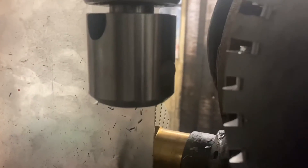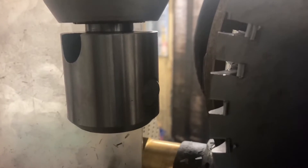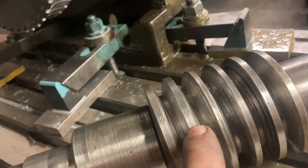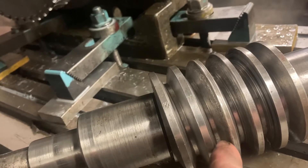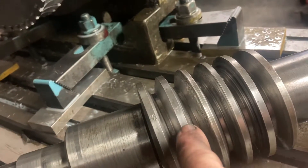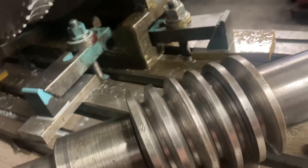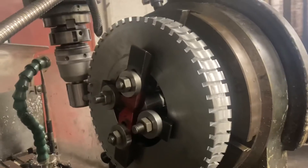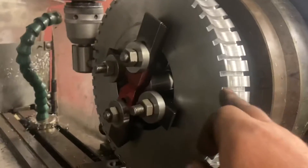The next job he's done is modified his roughing tool — ground it down, thinned it down — so he'll now make another pass and cut each of these teeth deeper. Remember, you're making a gap that that profile must fit into. He's cut it wider for the root of the worm, and then to cut right to the bottom where the contact surface will run, he's going to cut it far narrower. His next job is to cut all those divisions again but with a narrow cutter and deeper.